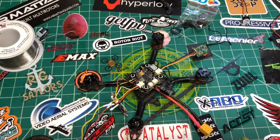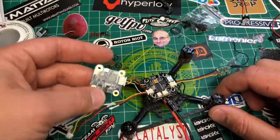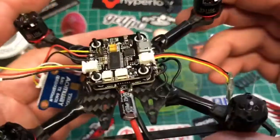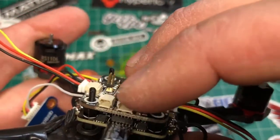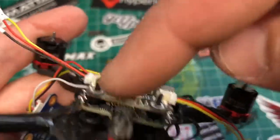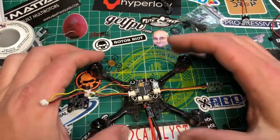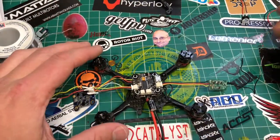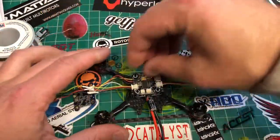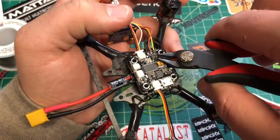As far as the how-to for the IS100, we are complete. Stay tuned for the review of the Airbot VTX. Now, if you have the VTX that comes with this — the Speedix VTX — it will slot right in here. You'd put another set of standoffs on and hook up your camera to that VTX. But 100 milliwatts — nah, I like 200. Because I'm not using these VTX stack pins, I'd recommend you snip them lower so they don't bang into anything, but make sure they're not touching or shorting on themselves.